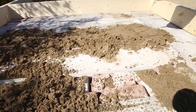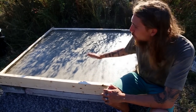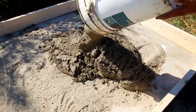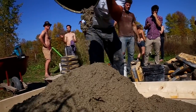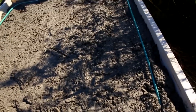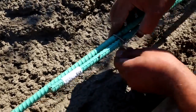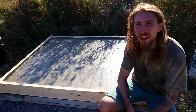That was the start of our foundation. From there we built a wooden frame so that we could pour the concrete into the foundation. We started off with a thick mix of concrete, and when we made it to the top we used a more liquidy, runny cement to fill the gaps. We put in some rebar to strengthen it and hold it all together, fastened them together with some metal wiring, and pushed it into the concrete. Now we're just here to let it dry.